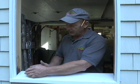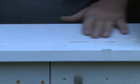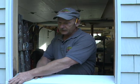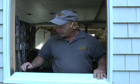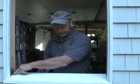And you'll only actually see, you see this line right here? You'll probably just see about that much of that sill. The rest of this sill will be covered completely with the replacement window. We're going to put some caulking in here. We don't really have to, but it'll just help to keep some water out, and it'll look a little cleaner and neater. So next step we're going to show you in the next shot, we're going to shim this sill up from the inside, and we're going to put some stainless steel screws down through it, and then we'll be almost ready to put in our window.